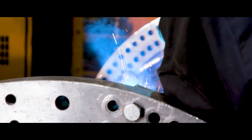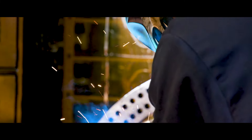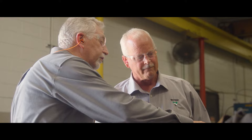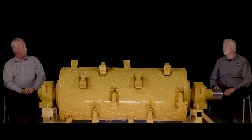There were some service issues with that original design, and as a result, some other companies had started using a drum design where they would weld their hammer on the surface of the drum. But it's difficult to weld something that's really hard — to be hard you have to have a lot of carbon, and when you have a lot of carbon you can't weld it easily.